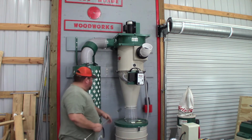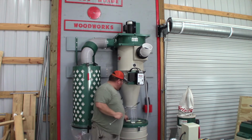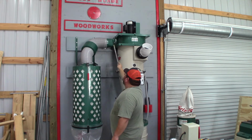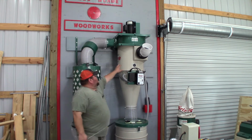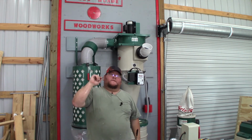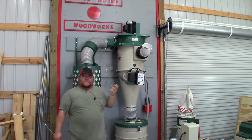So there's grooves in here on the inside of this hose where this will go, and it's everywhere. You'll know when to put it on there, and that just makes an airtight seal on it. There's some here, takes it here. Everywhere where a hose attaches, it's going to take this foam. Don't forget to put it on the inside of this. There's a cylindrical housing that goes and attaches to this blower housing. You do need to use at least medium Loctite, because you can't get to it, and if that thing comes loose after a while of it running, you're going to end up having to take this all apart to get in there and reattach it.